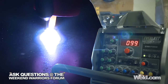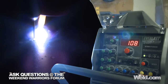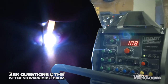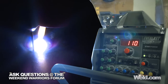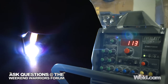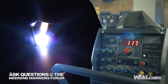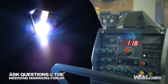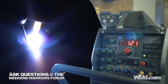I'm on DC negative, just on plate steel, and you can see the wire itself starting to run. I've got it adjusted pretty good — I don't know that I'm going to change anything on here. Now it's just a matter of how steady I am. You can see the wire just punching in there right at the start of the liquidus, and that's exactly where you want to have it set. It's not a matter of how much wire you're holding now — it's on a spool, so it's how much endurance do you have. I think I'm probably running 125, 130, maybe 140 amps.